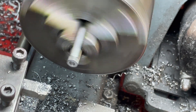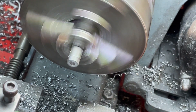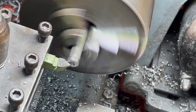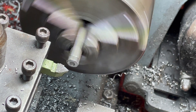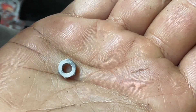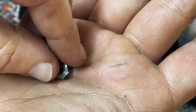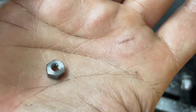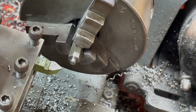You'll see as I change tools I'm going back to using the ratchet on the tool post. There we have a nice nut - 3/16 by 40 with chamfers on both sides and nicely turned faces. I'm going to do the rest of those and come back to you.